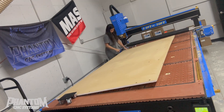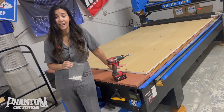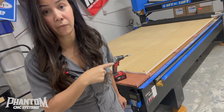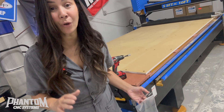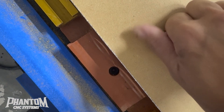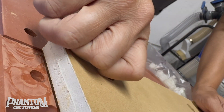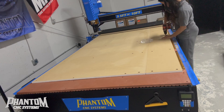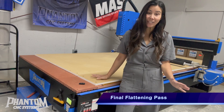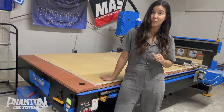Now the fun part — actually screwing down our spoil board. I've cut a lot of pockets and screw holes into this spoil board, but because we used Vectric to do it, I know everything is perfectly vertically aligned and this should be easy breezy. Don't forget to turn your vacuum pump on for this part — you really want to pull that MDF down as tight to your machine bed as possible while screwing it into position, to ensure the tightest seal and maximize your vacuum table's efficiency. Look how perfectly and quickly this spoil board is going down — that's because we used Vectric to perfectly align all our design files with Phantom's Spoil-Tite Mounting Kit. The last and most satisfying part is to run your final flattening pass, giving you a perfectly flat surface relative to your machine. Coupled with Phantom's Spoil-Tite Mounting Kit, you'll have one of the best performing spoil board systems out there.